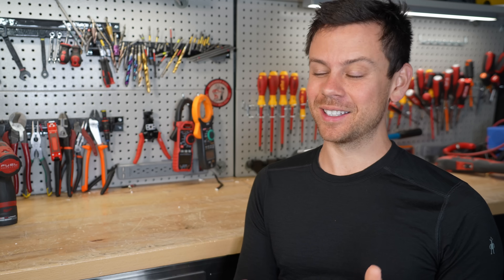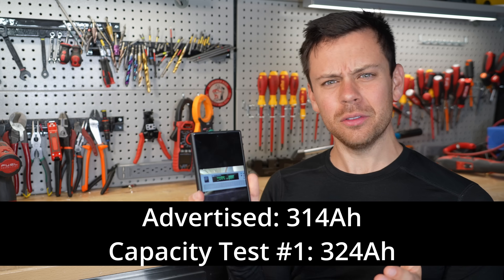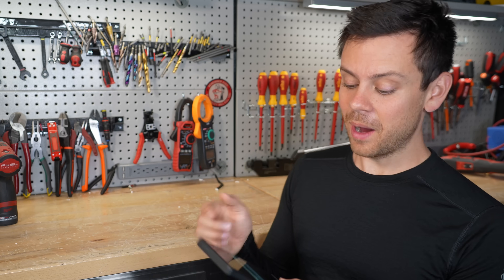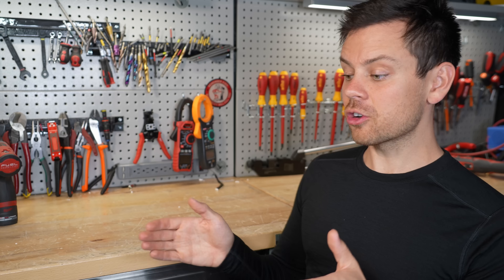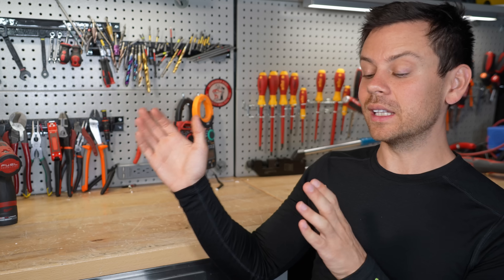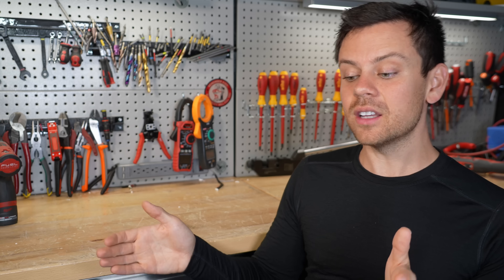For the next few days I tested the battery — we did multiple capacity tests. Keep in mind this is a massive battery, so it took a lot of work. For the first test we got 324 amp hours, which is okay, but I noticed the cell voltages were off — at high state of charge they were off by half a volt. That's a substantial amount, so I decided I need to balance this thing and we might be able to get more capacity. I charged it to 100% and noticed the balance current was 2 amps — this must be an active balancer. I let the battery balance overnight until the cell voltages were within 0.001 volts of each other.